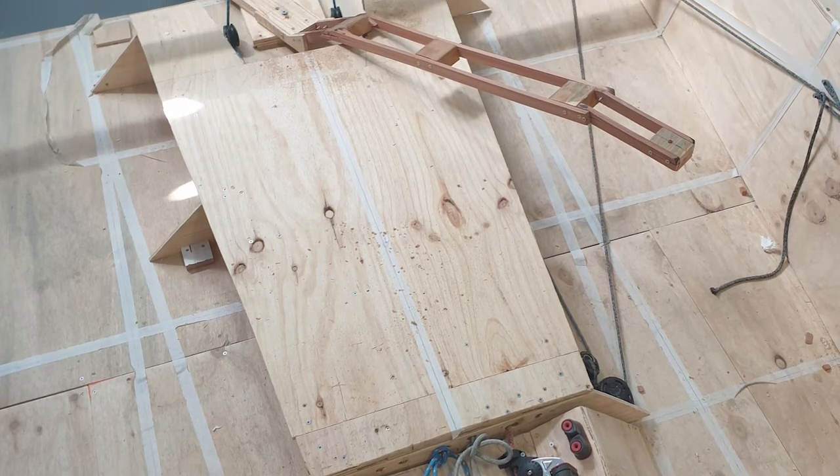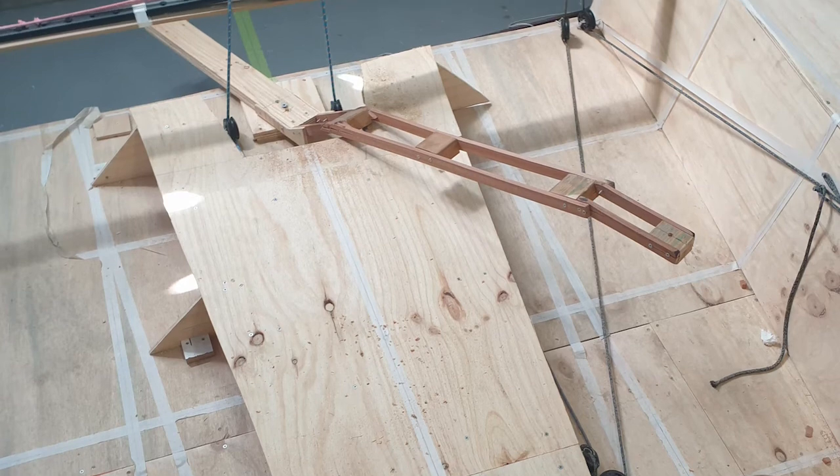It's all good and well to sit in front of a computer and design things — I know of many instances where something has been designed, the engineering works, the positioning works, but when you actually use it, for some reason it's just not quite right. I have the utmost respect for computer design, but in this boat's case the next process for me is to put all the fittings on the boat, then tilt it to 15 degrees, and with the boat on an angle work out things like foot chocks, placement of angles, where the beveled corners go in the cockpit — all based around where my feet go when I'm sitting 15 to 20 degrees on the boat.